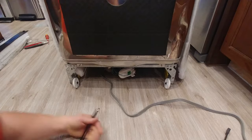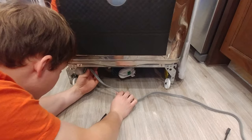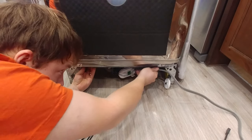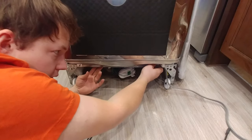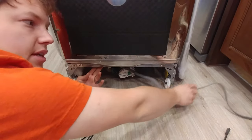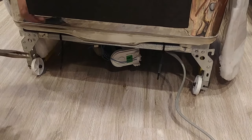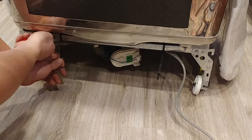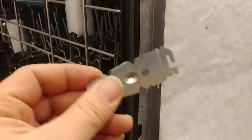We've got our sound isolating blanket back in place, and then we're going to take our power cord and use a few zip ties to secure it along this top rail here to keep it away from this motor, since our power comes in from this side over here. We'll go ahead and clip the extra off of these zip ties.